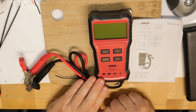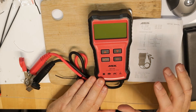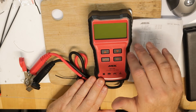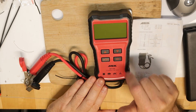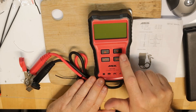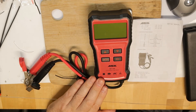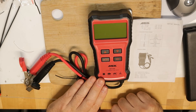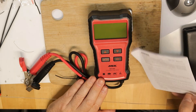Before doing the discharge test, it should first charge a capacitor inside that will power the microcontroller and LCD — even if the battery voltage drops very low during the high-current pulse. So I assume it first charges an internal 5-volt rail, then applies a very short pulse after you set the parameters, and tests if the battery voltage stays above about 11 volts under that high discharge current.